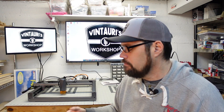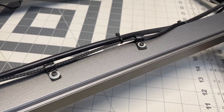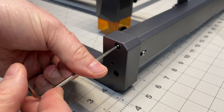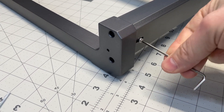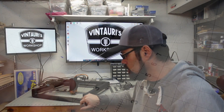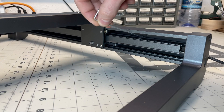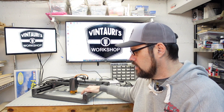I'm not going to go over a full build of this laser. They have a decent manual and there are not too many steps — everything went together fairly smoothly. They have cable management on top bolted down with clasps, and everything else is assembled with button-head metric screws. Belt adjustment is done by loosening the side nut and inserting an allen key into the front, though I find it a little tough to see exactly how tight or loose the belts are, and it does make maintenance a bit difficult.